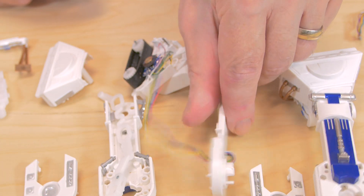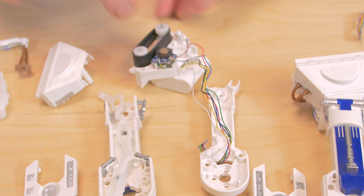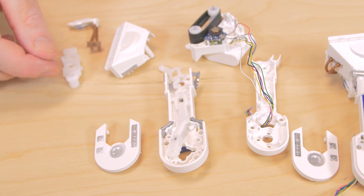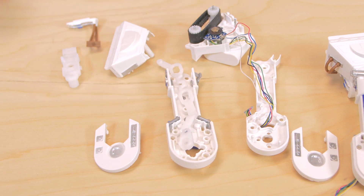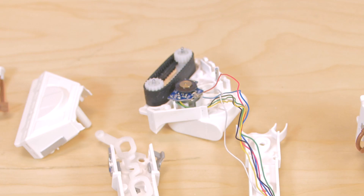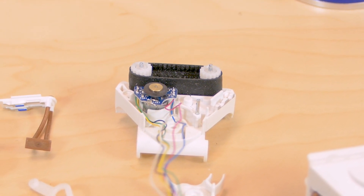With R2's arm off, the wiring to the servo motor in the base becomes evident. There's also a cover on the inner surface of the leg that pops off to reveal a long plastic lever arm between the pivoting mechanism in the shoulder and the foot. This lever arm keeps the foot in contact with the ground when the leg pivots. R2 has a servo motor in the base of each leg. The servo motor connects to the track drive through a gear train that reduces motor speed and boosts torque. The servo motor and gear train become visible by removing a small cover in the foot. It's evident that the servo motor includes a feedback loop because a magnetic encoder disc and Hall effect sensor are visible on the motor shaft to provide feedback about the position of the motor shaft.